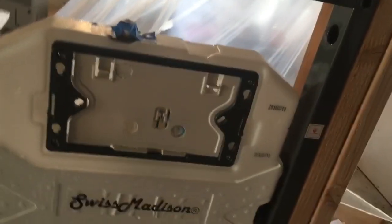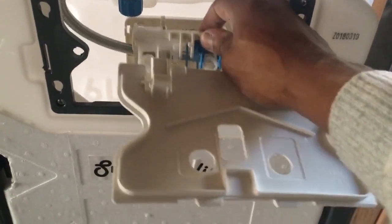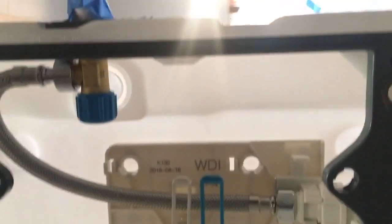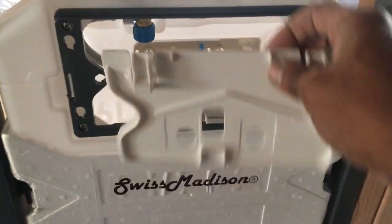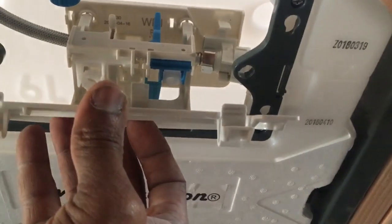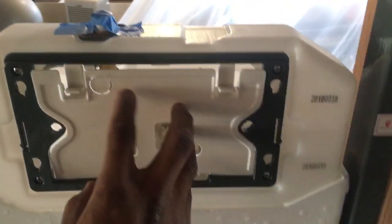So after the inside connection is made, you'll put this cover back on. This right here just comes straight out. And you're gonna line it up. Let's see, I'll show you that. Put some tape over it. I'll have to come back to it. I ran out of blue PEX pipe. I only have red left, and I don't want to use it, so I'll go and get some. That goes there. This one. You're gonna hear 2 clicks as it fully seats in. So one on the left, one on the right.